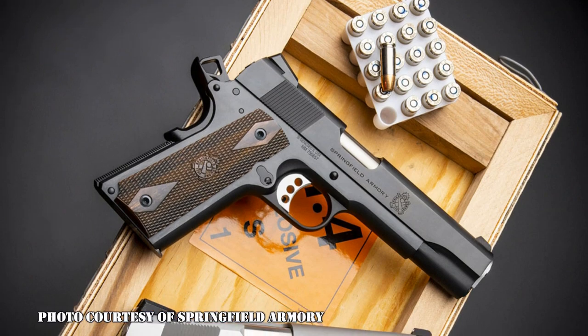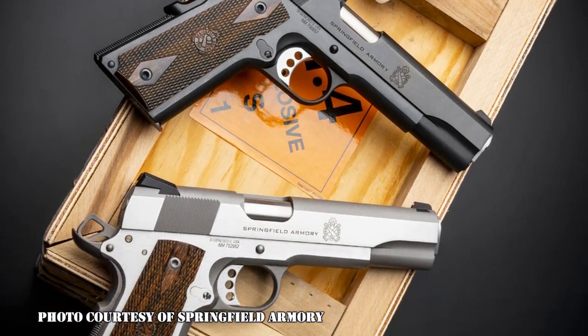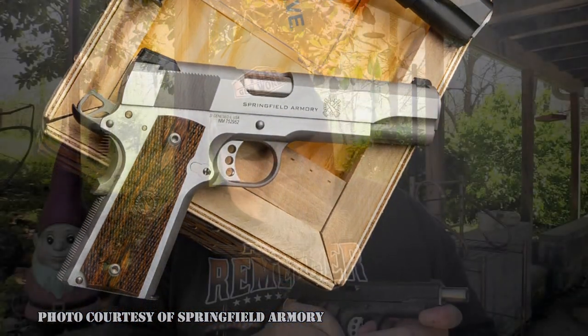The 9mm Garrison is available in either blued carbon steel, as the example I have here, or in stainless steel. The blued version is forged carbon steel. The slide and the frame are forged, very nicely blued. This is a basic 1911, but it's got a lot of features that you want on a 1911. The slide has angled cocking serrations, as you typically see on a 1911 pistol, angled towards the front of the pistol and located at the rear of the slide.